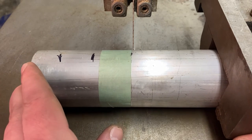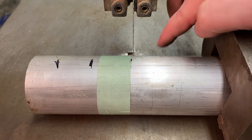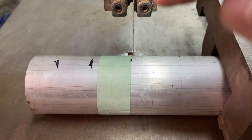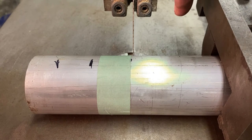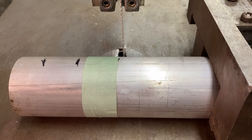Let's bring this back a little bit. We're going to hit start. I'm going to look at it from the top and try to look over this edge to the other side, and then once I get through I'll start keeping my eye lined up with the tape and the blade. Make sure your piece is backed away from the blade, nothing else is in your workspace, nothing is in the way of the blade, all guards are in place, and you have your safety equipment on — earplugs and eye protection. No gloves. Let's get started.